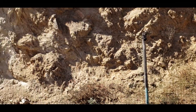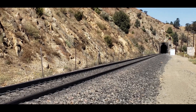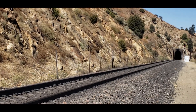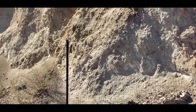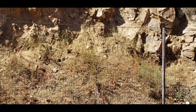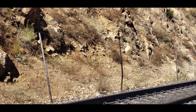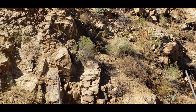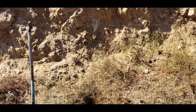We have another one down between Cliff and Rowan, between tunnel seven and tunnel eight, which you saw — I posted the train going through there a while back and I'll link that in this video. But that one works differently. It actually has a series of wooden posts rather than steel posts. It starts out with one leg of a DC circuit hooked up to the bottom wire on that fence — about 10 or 12 wires stranded up, hooked together at each end with a piece of wire. So you have one continuous leg of a DC circuit going through the entire fence. If a rock were to come down and break one of those wires, it would open the circuit. It doesn't use control boxes of any kind — it's just a straight leg of a circuit.